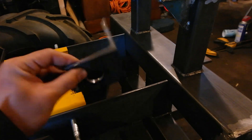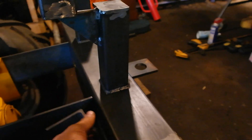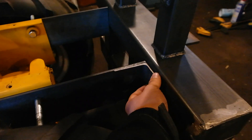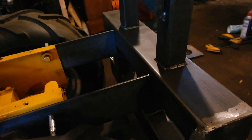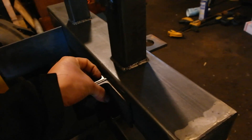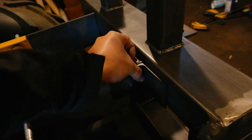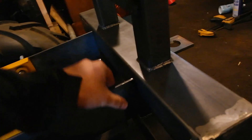These are made out of 3-inch angle iron, 3/16ths of an inch thick, with a 1-inch hole in them. I'm going to weld them to the backhoe control station like this — there's going to be two for each mount, one on each side. I'm going to weld them in place and that's how the backhoe is going to mount to the subframe using 1-inch pins. There are going to be four mounting points total — one here, one there, and also below.